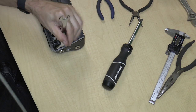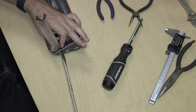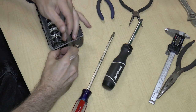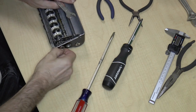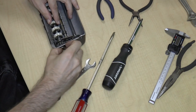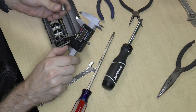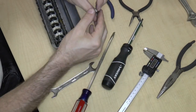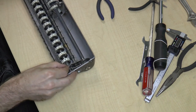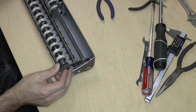It would help if I held onto the nut. Remove the screw from the end. I'll just hand-turn this now. I'll have to push it out. I'm pretty sure this measurement is the same as the others — 0.395, which is pretty close. And 0.560, which is also pretty close. It also has a set screw. Now I should be able to simply lift out — well, maybe not simply, but with some manipulation. There we go. I can just lift this out, just like that.